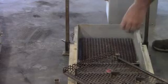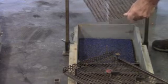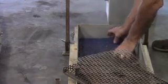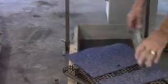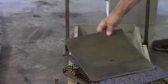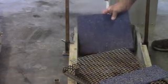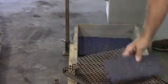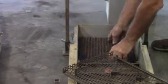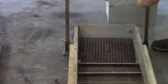So underneath that, we've got raised expanded metal. The raised side is like a little riffle, so this will help catch all your fines. Under that is miner's moss, and under that is just rib matting. So we've got layers of catching material for different sizes of gold, and it just does so much better. After this modification and that changed-up punch plate, all my gold, or at least 99% of it, is right here underneath the crash box.